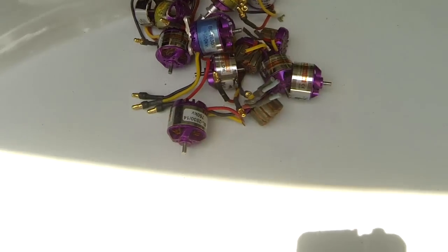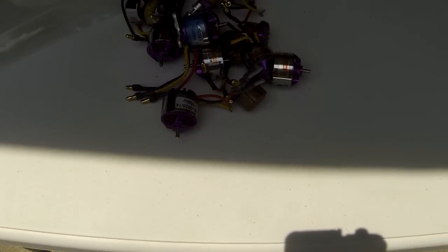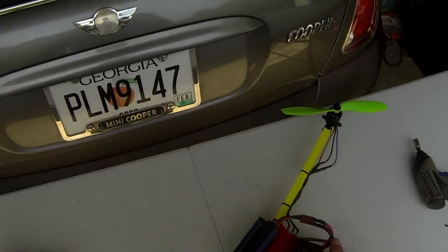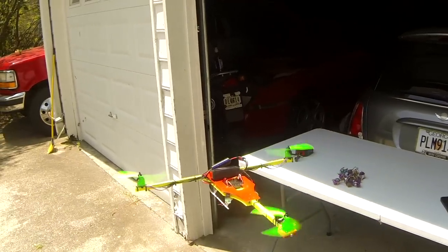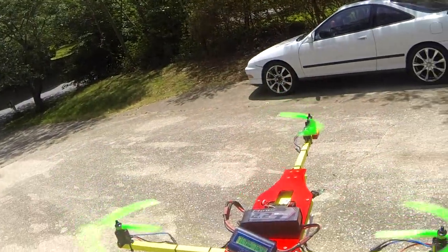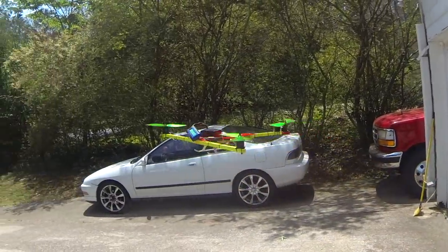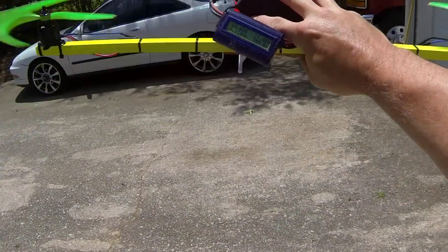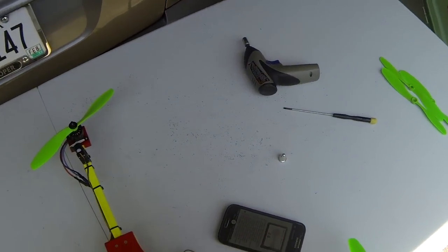This is the other reason I'm not a big fan of cheap motors — these are all the ones I broke in the past due to messed up magnets, bent shafts, pulled wires, just general bad things that happen. So let's go ahead and do the efficiency test at hover. Not much difference — maybe half an amp. Let's go ahead and do a throttle-up test. I'm getting about 65 amps full throttle, so it's about 15 amps more, which means they have more power.